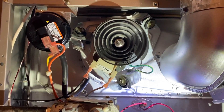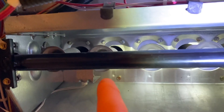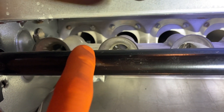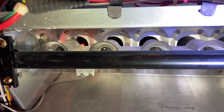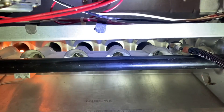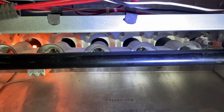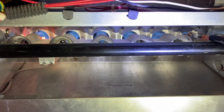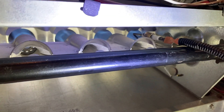The inducer motor just kicked on and the fan is spinning. From here we're waiting for that little tab way back there — the igniter — which is going to heat up. Once it gets to a certain temperature, as the gas flows over and past it, it will ignite the gas and all burner tubes and chambers will light up, shooting the flame straight down inside those internal chambers.